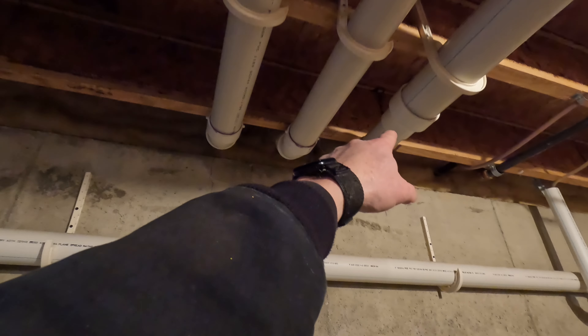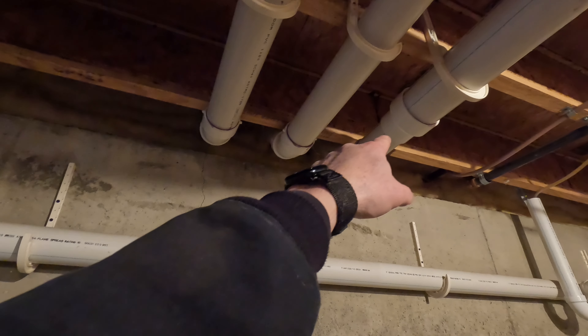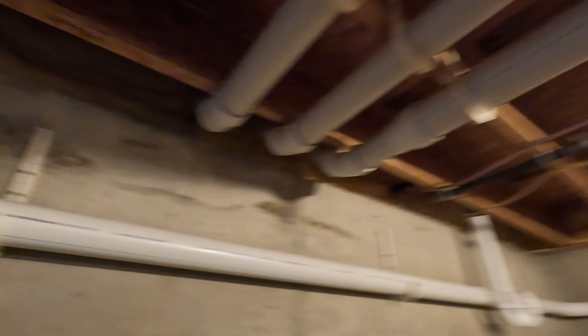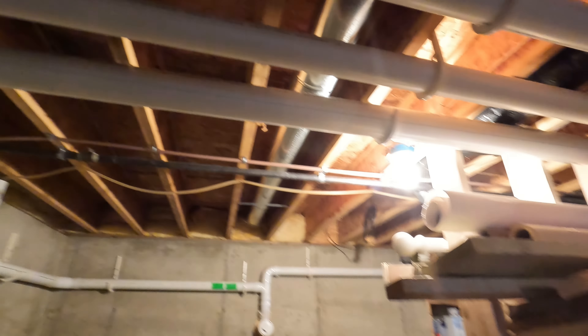That's a big no-no. It went from four inch to three inch — there's a reducer coupling right there, and that's for the water heater. So this one's the intake. I think what I'm going to do is force clear these codes and then we'll see what happens. I'll keep you guys posted.